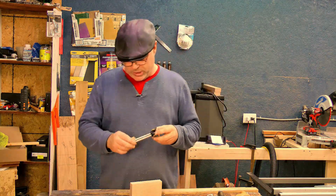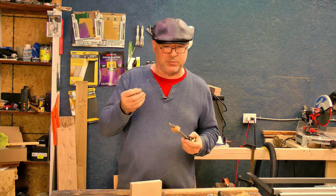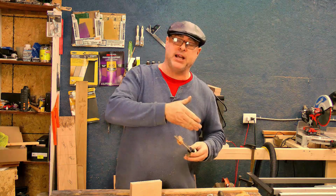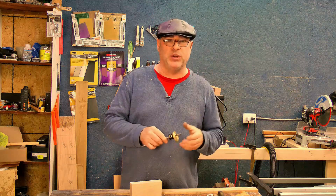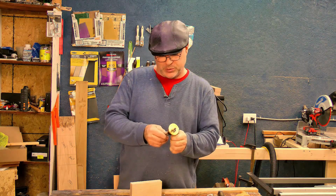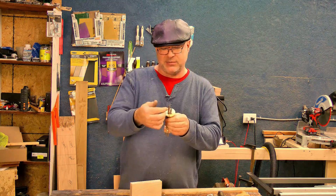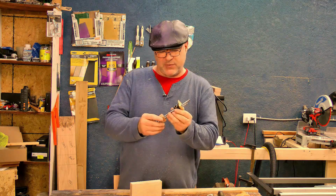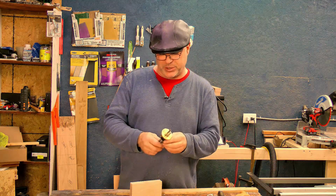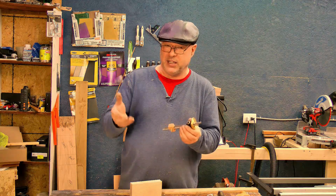So if you're thinking about buying one, keep in mind that this clamp may not work. I don't know if it's going to work on any other ones or not, but this was my rant. This thing's just a hunk of junk. So you're going to have to make your own or buy a different type. I probably am going to buy the wooden one. The wooden one had a screw that you screwed down so you could make your adjustments and move your two markers in unison. This way they stay even, because if not, you don't have a clamp for this. You're going to have to adjust each one, and it's going to be really time consuming when you want to do your mortise and tenon. Whereas if you have the clamp, you can adjust it to where you need it to be a lot faster.